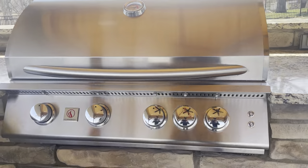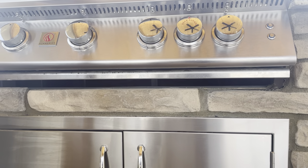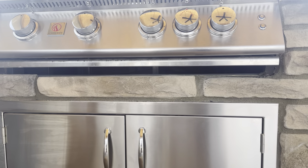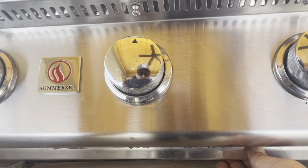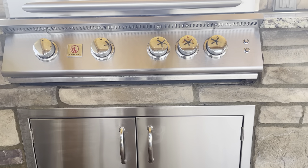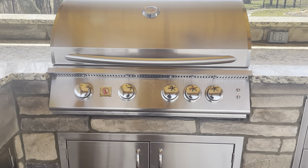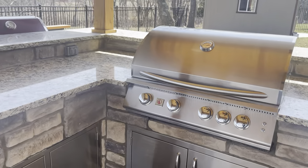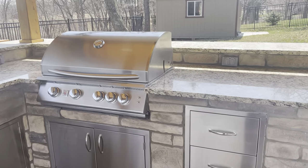There's always going to be a little gap underneath the grill — keep it to a minimum but you always want some airflow. You'll also get a little airflow through the doors since they're not a 100% seal. When you pull on a drip pan, you don't want it stuck on stone, so a little air gap is fine. Just minimize it so it doesn't look unsightly, and make sure the stone between the grill and doors isn't so narrow it looks silly or will fall off.